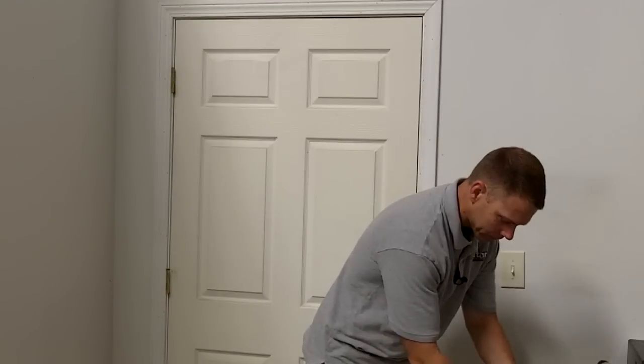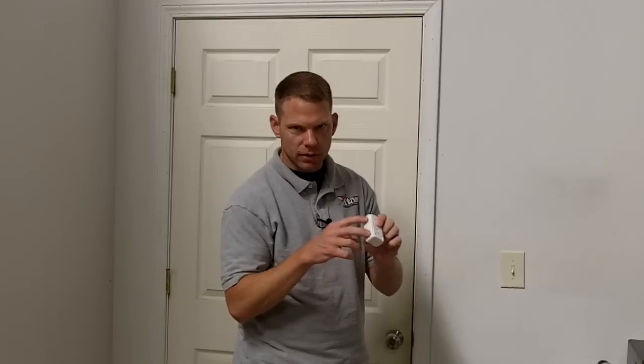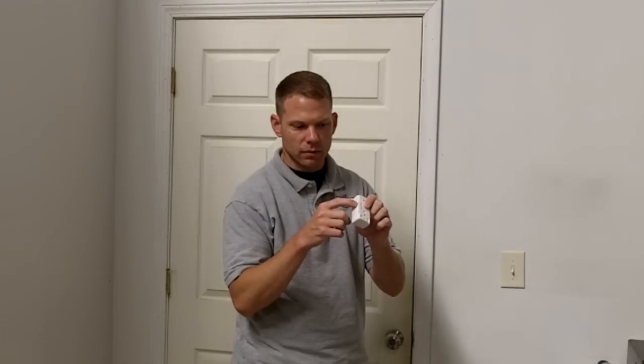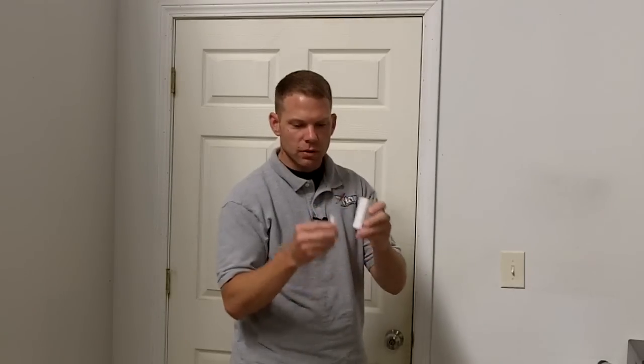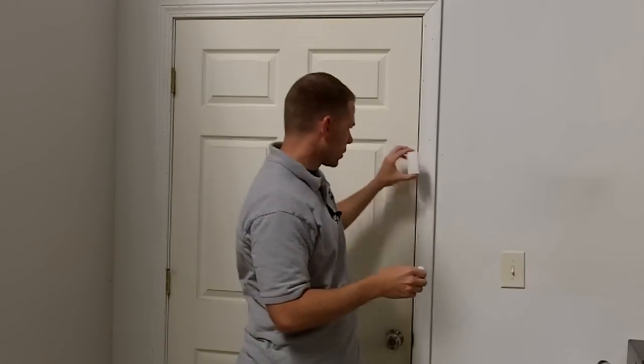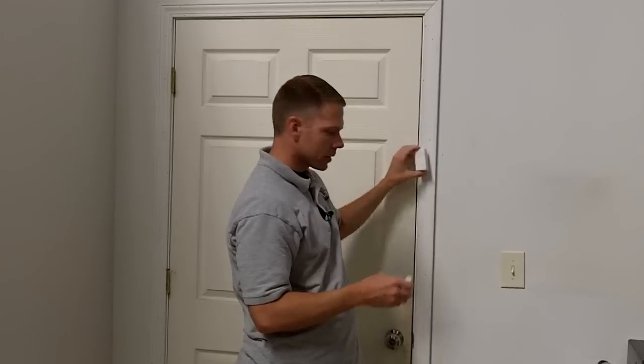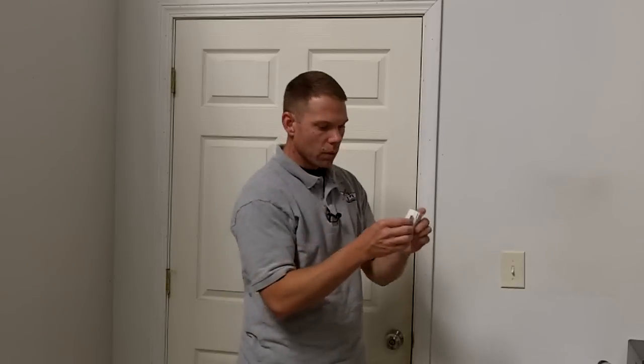When you line this up on the door you'll have a magnet that comes with it. If you look on the side of this contact, you're going to see two little lines that mark where that magnet is supposed to go. There's a reed switch in there and that's what recognizes when the door opens and closes. You can mount the transmitter on the door side or on the trim side, either one. You just want to make sure that these line up. When that swings open and those separate, that's what causes that contact to send a signal into the panel.